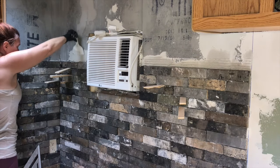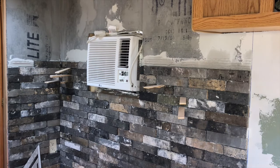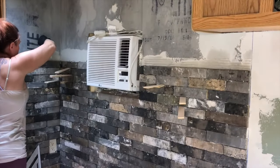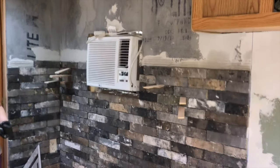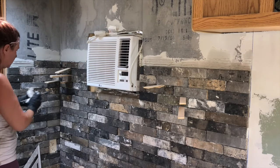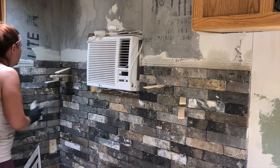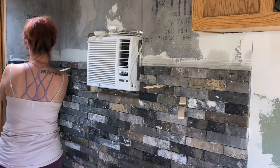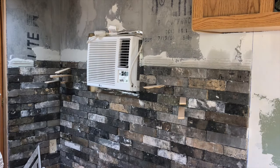We found some really cool reclaimed brick from Floor and Decor and decided to go with the dry stack method rather than putting up spacers for mortar joints. Applying the brick veneer to the Wonderboard is time-consuming but fairly easy. Chad cut around 15 bricks giving me 30 halves to get started on a standard running bond pattern. I applied a thin layer of mortar with a quarter-inch square notch trowel, then back-buttered and attached each brick. To back butter I used a six-inch plastic drywall knife to add a little more mortar to the back of each brick.